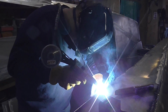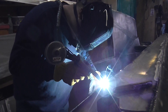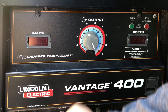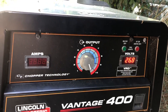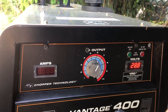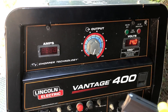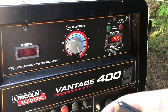I can use that box from Lincoln and plug it in, but you always have to reach with a second hand — or you can use a slider taped right to your MIG gun, especially if your settings are synergic. On the Lincoln, it's a little different. No matter where you set your max output, the remote takes over and you always have full minimum to full maximum on the remote. You don't have the option like the HTP, where you set your max and can only go from zero to that max. But it's the same concept — it's a remote control.